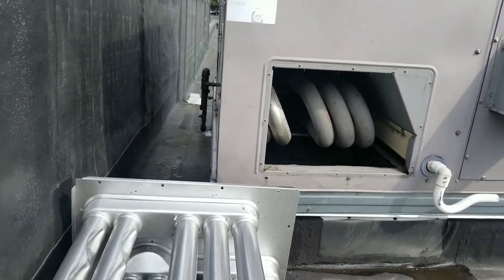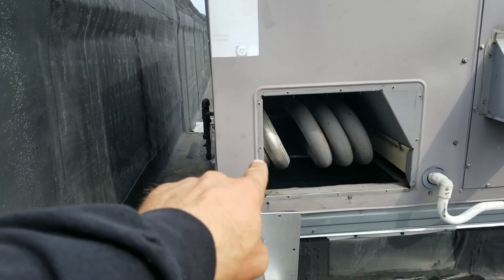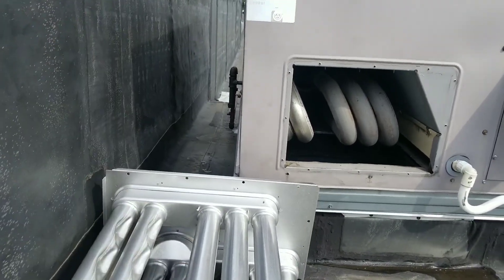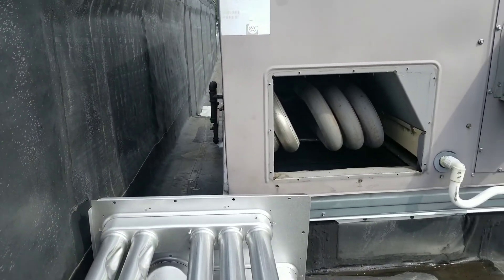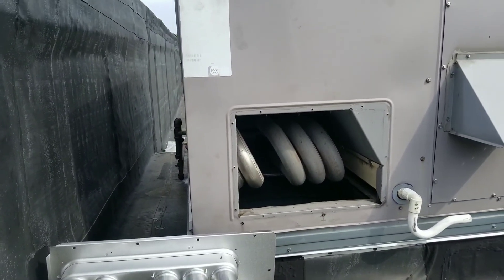This is the challenge I'm talking about — there's my old heat exchanger. Normally it just comes right out the side and you throw it away and slide a new one in, but there's not enough wiggle room inside that cabinet to twist it and then lift it out. So let's move on and see what we can figure out.